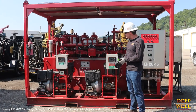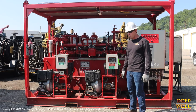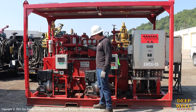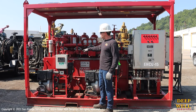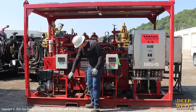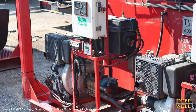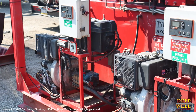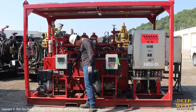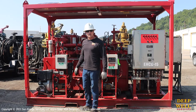I'm going to start by looking at the fluid pump and how it pressurizes the bottles. Back here we have our primary fluid reservoir that holds all of the fluid in its unpressurized state. It gets drawn into the charge pump right here, which pulls it out of the tank, pressurizes it with a small triplex piston pump, and then distributes it into this main line where it goes around the back of the unit and into the accumulator bottles.